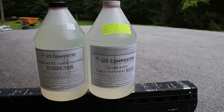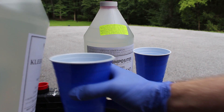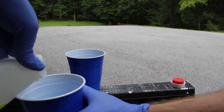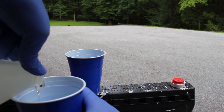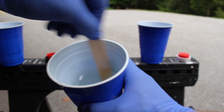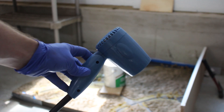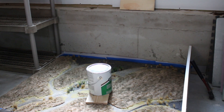In the final step, the water. A board this big takes a lot of resin. Here in the US, the cheapest sort of bulk resin is a company called US Composites, which you can order online. It's a 50-50 mixture and you'll pour the hardener into the resin liquid. The number one mistake people make when mixing resin is not stirring long enough — each cup takes four to five minutes to stir properly. If you stop too soon, your resin will be cloudy or tacky. When you pour the resin, it helps to have a hair dryer to draw out any bubbles. Finally, I leave a paint can in the middle of the board to help keep my table from warping while the resin cures overnight.